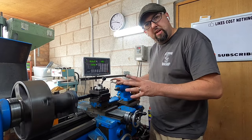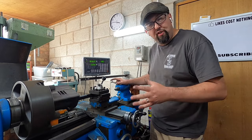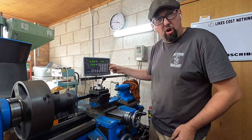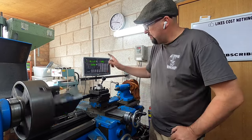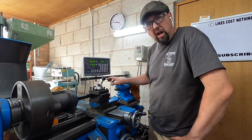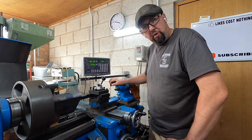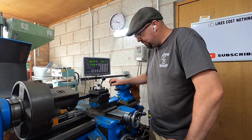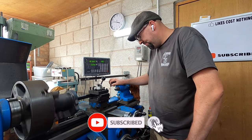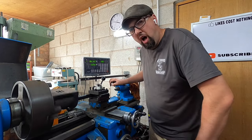We can't be fast with this, it's got to be quite slow. At the minute I'm taking 0.2 of a millimetre cuts, so overall I'm taking 0.4 of a millimetre off the diameter. As you can see, I've actually installed my X axis DRO on the lathe so I know when to stop when I get to the end. It's quite valuable that. I couldn't really do with the Y axis on — that would make it a bit easier. It's about halfway through this cut.